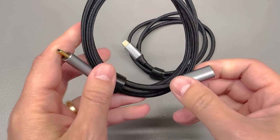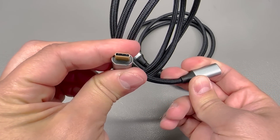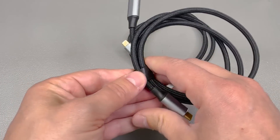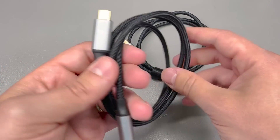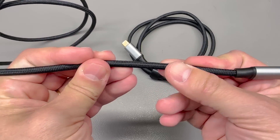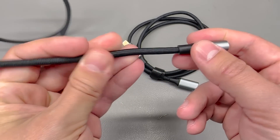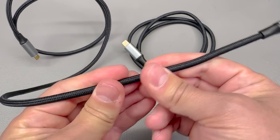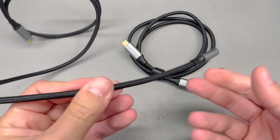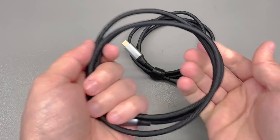Next up I got a couple of these one-meter long USB Type-C extension cables — female connector on one end, male on the other — with the plan to extend my watch and phone wireless charging pads to a different wall socket, freeing up my nightstand socket. I'm not too happy with them though; they're a bit thick and stiff because they're rated for USB 3.1 at 10 Gbps and 100W power delivery. In my case, standard USB 2.0 data plus a 15W power rating would have been enough, but they'll still do the job hidden away.